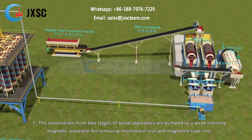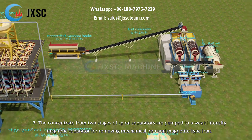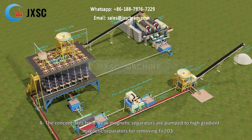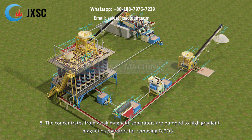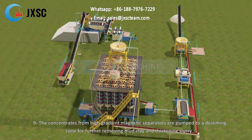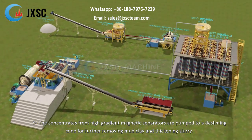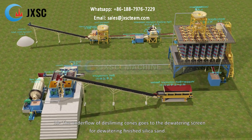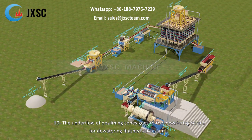7. The concentrate from 2 stages of spiral separators is pumped to a weak intensity magnetic separator for removing mechanical iron and magnetite-type iron. 8. The concentrates from weak magnetic separators are pumped to high gradient magnetic separators for removing Fe2O3. 9. The concentrates from high gradient magnetic separators are pumped to a desliming cone for further removing mud clay and thickening slurry.